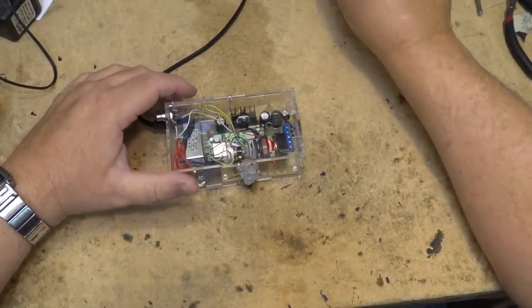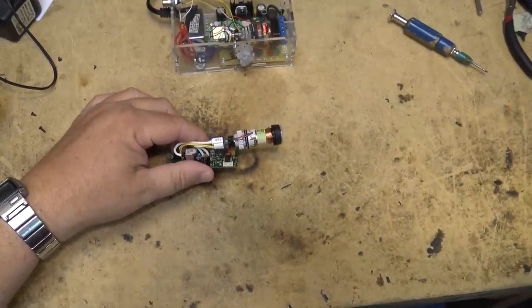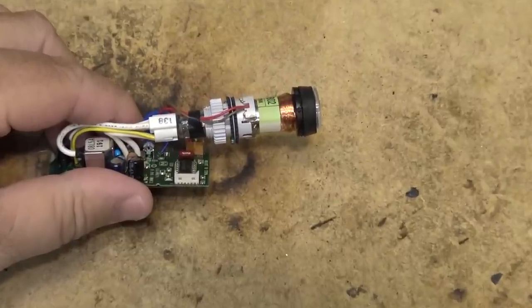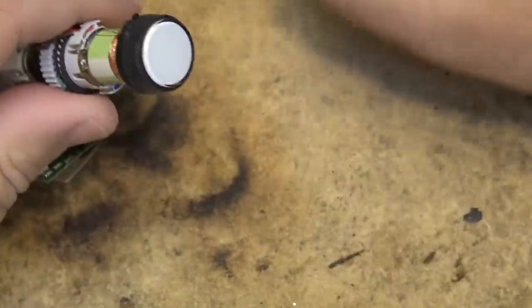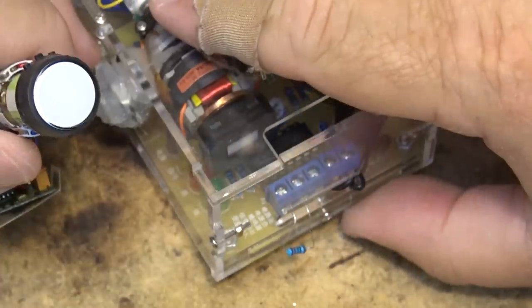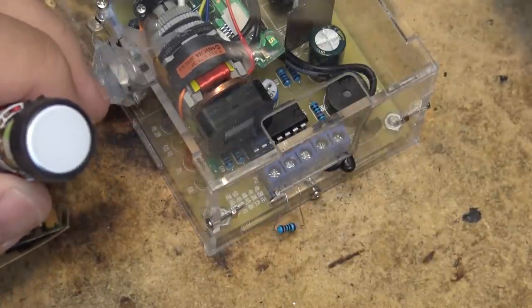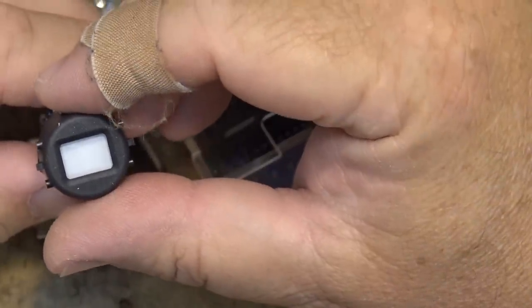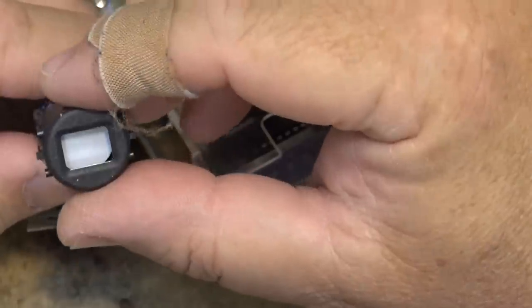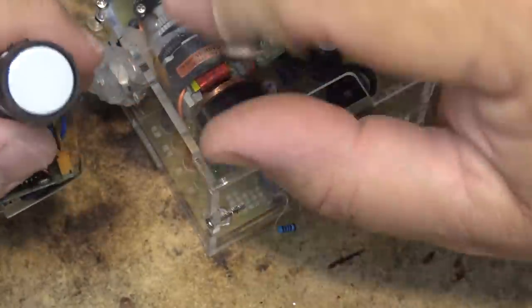Here is the other smallest CRT in the world, but this one was slightly larger — it measures just over half an inch and it's a round tube. There are some real differences between this tube and the one in the camera. It had a mask over the front to make it look like a square picture, but it was actually a round tube. A lot of cameras used these round tubes — it's a half-inch picture, but the tube itself is actually two-thirds of an inch if you measure the faceplate.